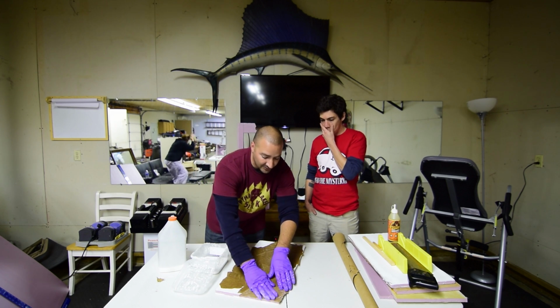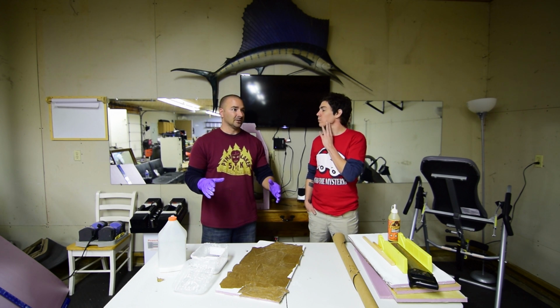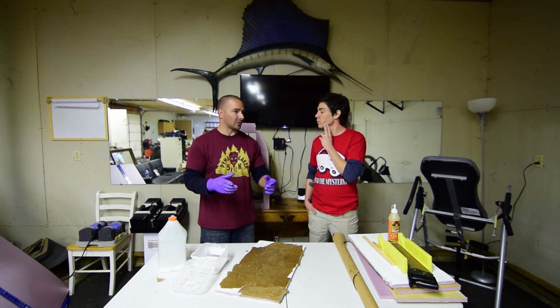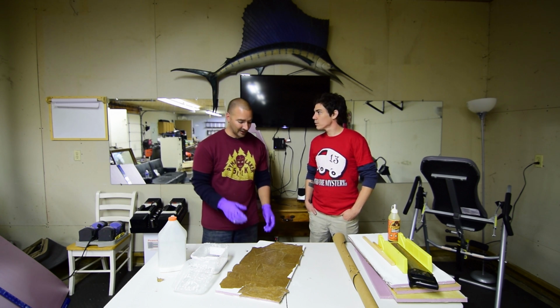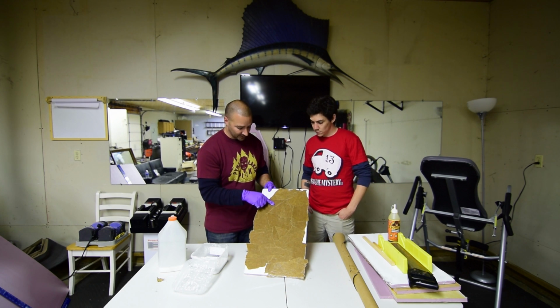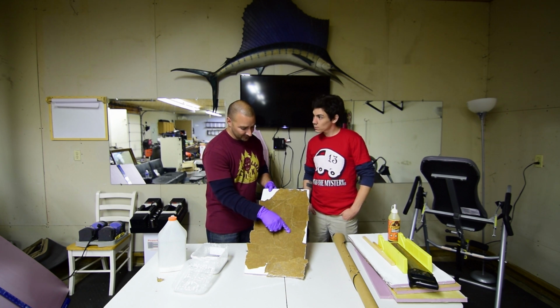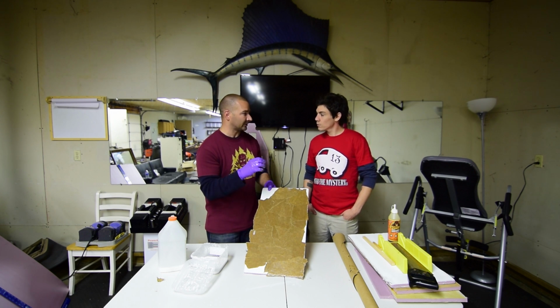If you go back to the van tour videos we started with, you'll notice one had really light cabinets that were almost an almond color. The other one had a real deep, rich chocolate color. So you can go anywhere from blacks to cherry, the redder tones. By adding the stain, it's hard to see with this, but you can start seeing all these lines of grain come through, and all these different boundaries between all these pieces. They will pick up that color and really give it this veiny, spidery look.